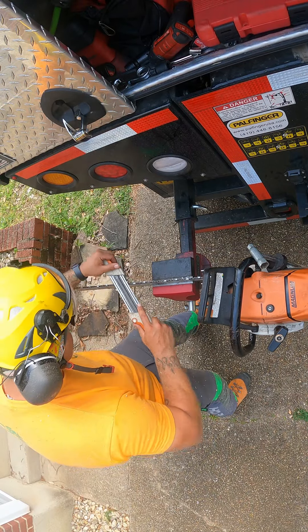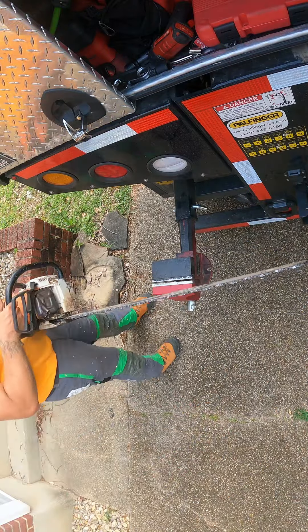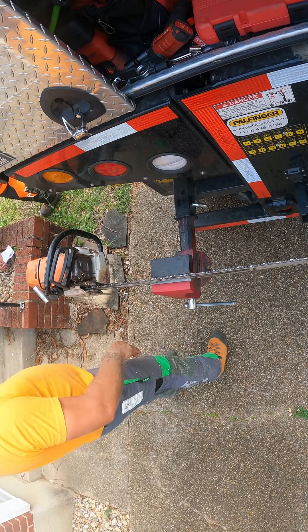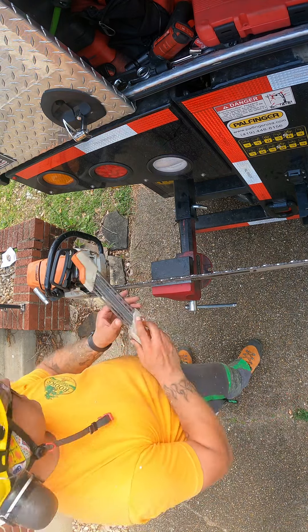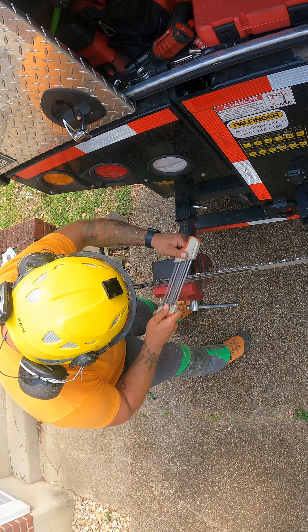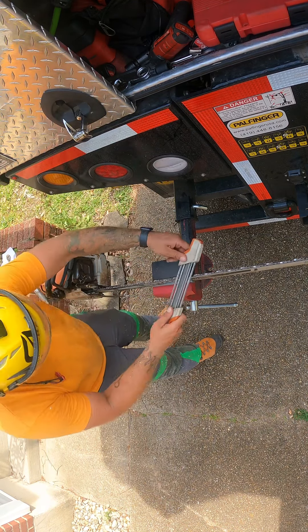Funny story — my mother-in-law's husband, stepfather-in-law, old Bob, he had one of those files. And I'm like, he don't know what he's talking about, that's for sissies. Just being dumb and not knowing any better. I always used a round file, and I used one wrong when I first started — I didn't kind of pull it up into that top piece of chrome and get it just crisp. If it's not getting on that top, if you don't have one the right size, it ain't going to cut. You want to keep the gullet clean underneath the tooth. I like to keep that cleaned out — I'll grab a file a size smaller or bigger and keep it cleaned out, even if I'm just round filing.